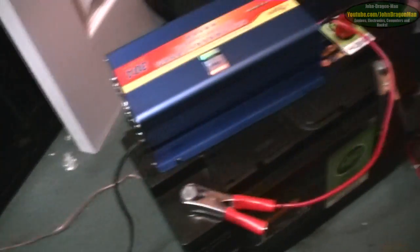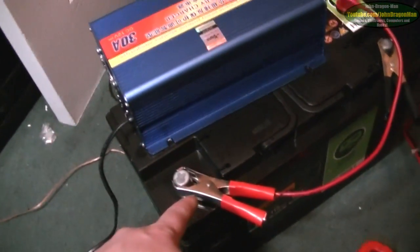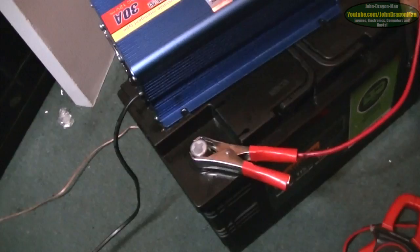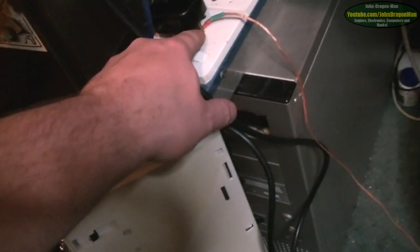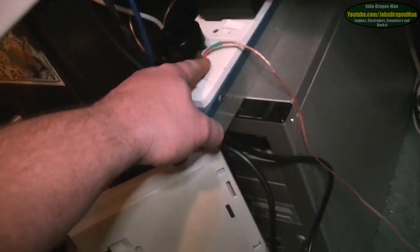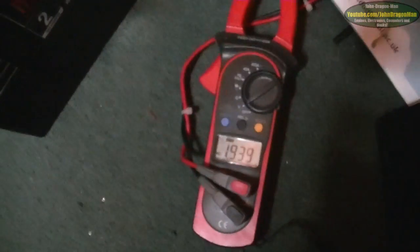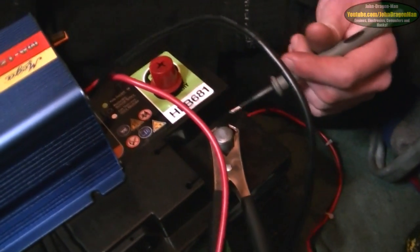We've also found that if you touch one of these leads and touch a ground, or you've got no shoes on like me and you're touching the floor, it gives you a right shock. You'll see here we've got this cable leading up to the earthing pin of a standard home outlet plug socket. My brother's there, just touching that probe for the tester on it. And what the hell's this? Bloody hell, that's 103 volts it's chucking out there.